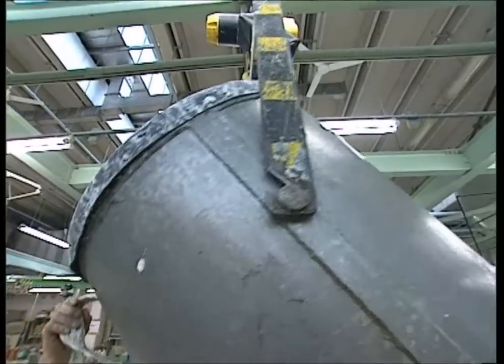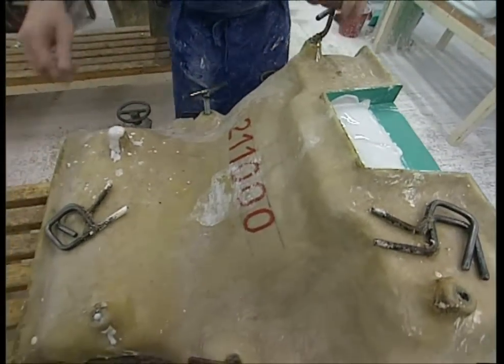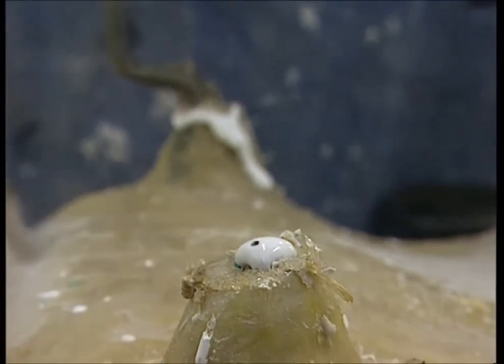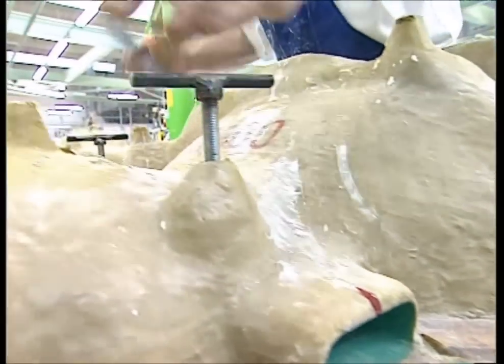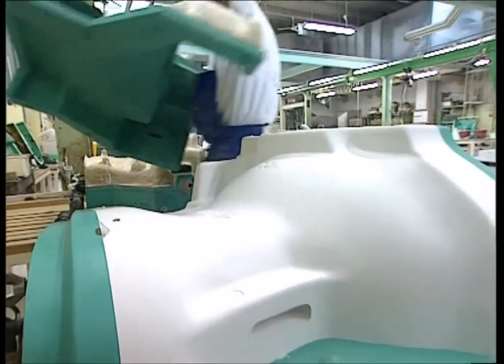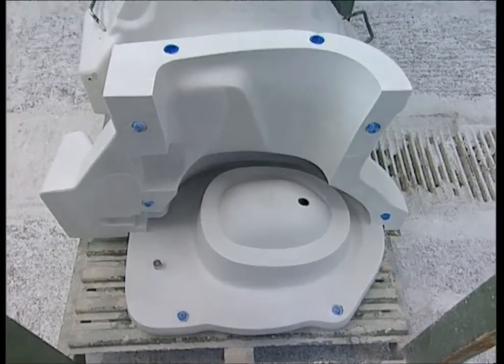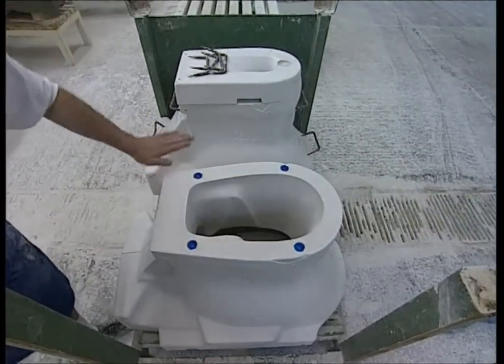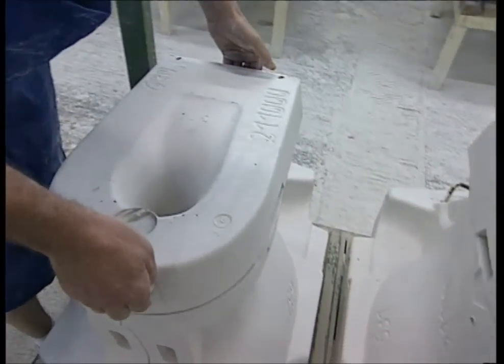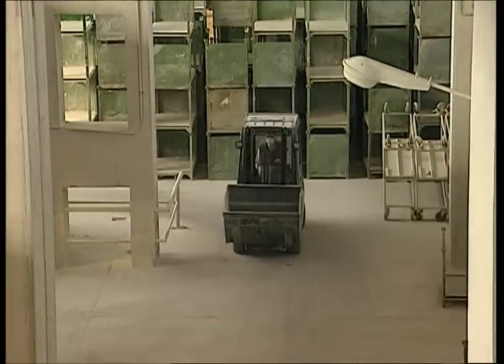The mold for the toilets is made inside this casing. They pour in a liquid compound that contains gypsum, a natural mineral that soaks up moisture. This will draw water out of the clay bowls so they'll dry quicker later on. The mold is made in four parts which set in just 20 minutes. The gypsum can only draw out a certain amount of water before it's saturated, so these molds can only be used to make about a hundred toilets each.